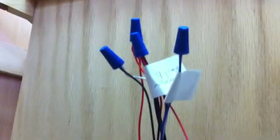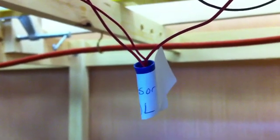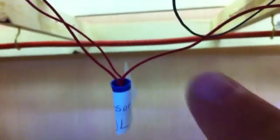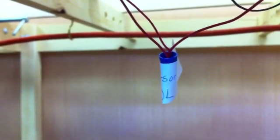We will come back and solder these at some point — Doug does that, not me. Here's an example of sensor six, which had three different power leads into that section of track. This wire goes right to the track, this wire goes back to the control board, the BDL168, and this wire goes to the next detection zone — it piggybacks through. I've found that's the easiest way to save a lot of wire since it is expensive. We used 18 gauge wire throughout and it's worked out pretty well.